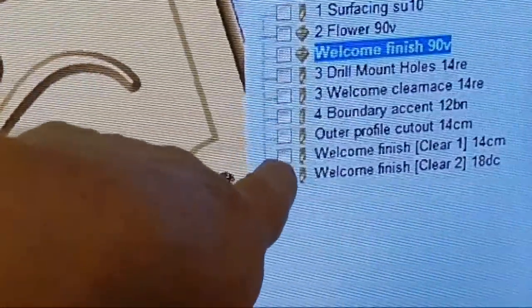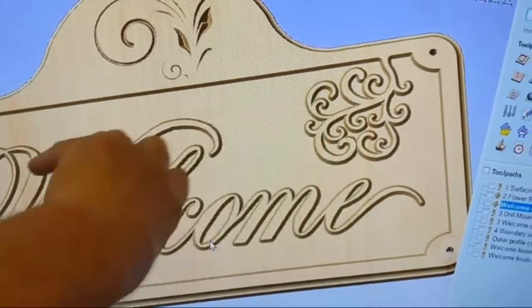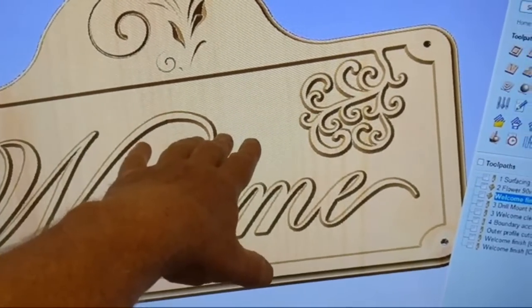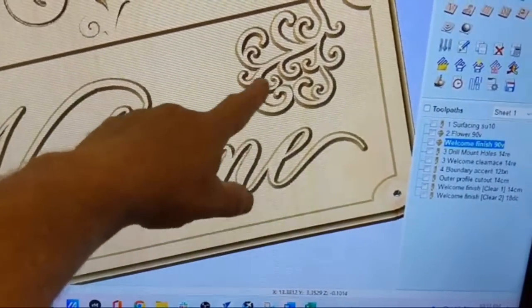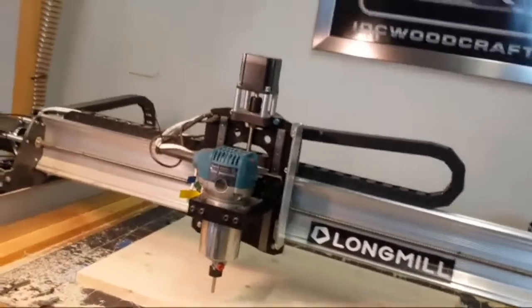All right, and then the finish. So we're just going to get in here and do the finishing. The roughing is going to come through here. It's going to be a 0.15 shallow, and then we're going to come in with the 1/8 inch bit, clean it up, and then I think the sign will be done. So I got the 90 on there,